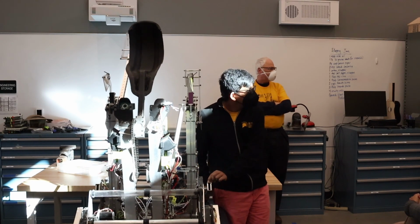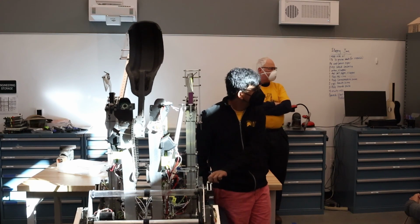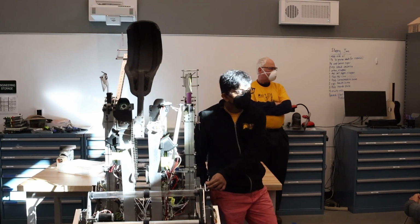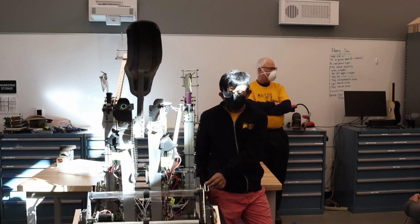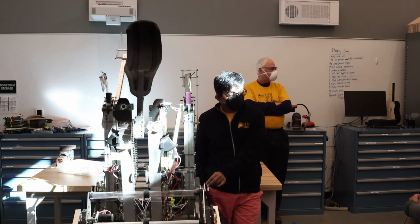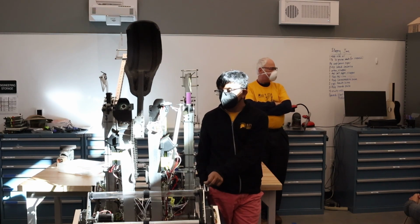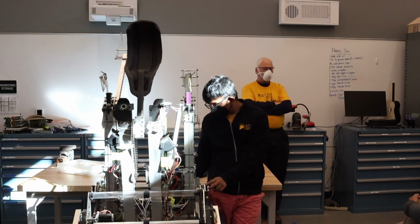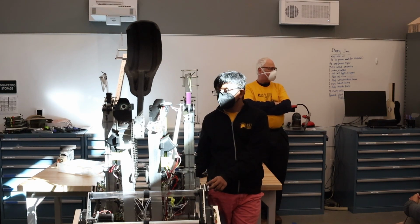But still, electrically, you could make that input float by having a pull up or pull down resistor, so that in the event the potentiometer wire fails, it'll pull up or pull down, and essentially software will look at it and say, hey, wire broke, therefore shut down. Well, I came from industry, and they do that in heavy equipment. They don't rely on a switch activating when you hit the limit, but the switch deactivating. So if a wire breaks, the system doesn't even work, and then it's a pain to go troubleshoot, but you know.